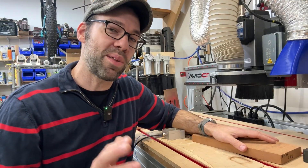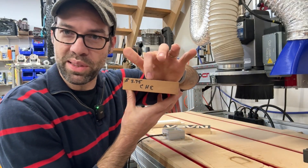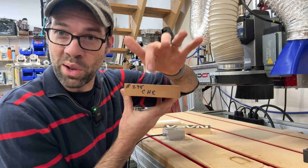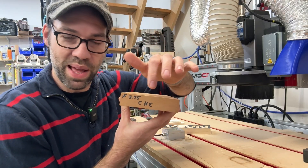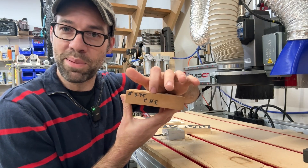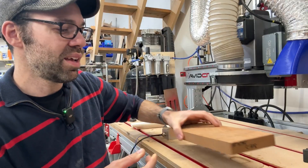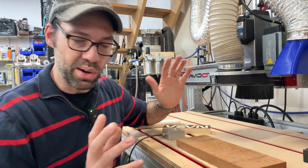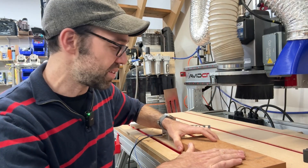The way to think about the G-code math is that the math starts by putting the bit on the top of the material and pushing it down 1.02 inches. This will happen in multiple passes depending on how you have your toolpath set up, but the critical thing is you're starting from the top and pushing that bit down 1.02 inches. Z-zeroing to the top of the material is really common and you can do it on all kinds of different jobs — it certainly works fine on a scenario like this.